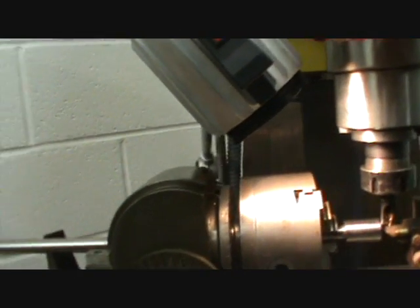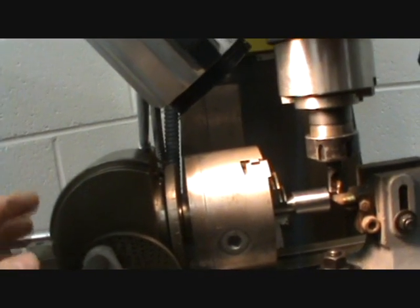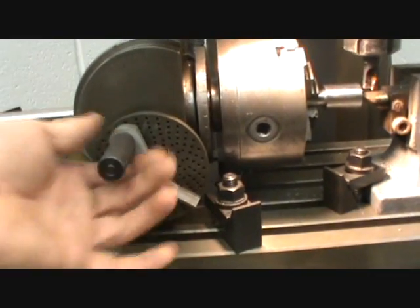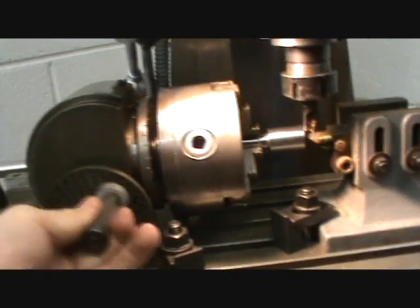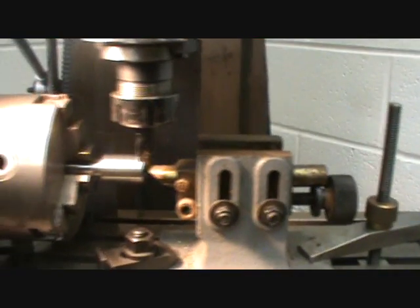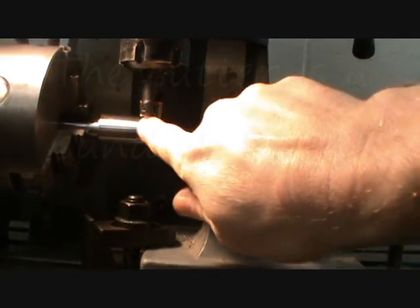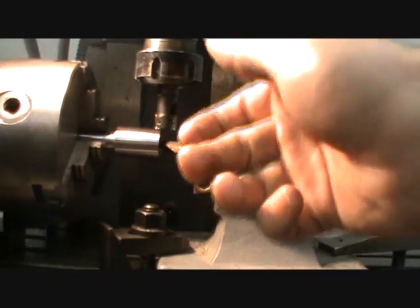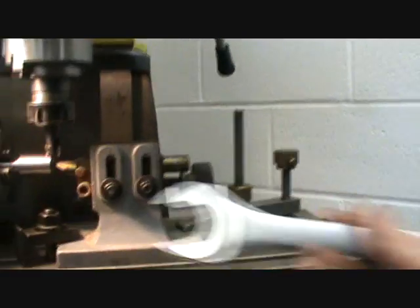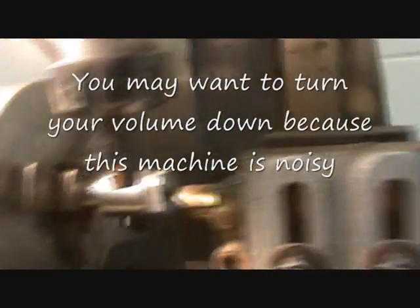I'm only going to be doing 4 flats. I can use any plate and any set of holes — 4 divisions means, because it's a 40 to 1 gear ratio, it will have to be 10 full turns, which will move the workpiece one quarter of a turn and create 4 flats. I've got this bit here which needs taking off so I'm going to skim it down, do it 4 times, and check it with a spanner. I want this 21mm spanner to fit over it, so I'll take a few more cuts.